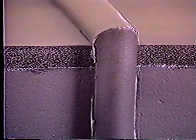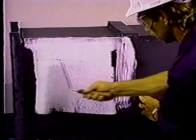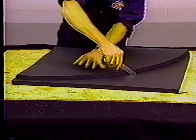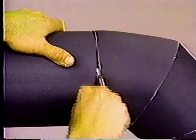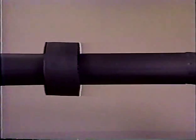If ducts or any other flat or curved surface or insulated piping is located outdoors, it should be protected with a protective coating, brushed or roller coated. For best appearance, apply two coats. When the job calls for foam insulation, all you need is a sharp knife and your now-sharpened skills to work with this efficient insulation. Make sure all seams and joints are tightly sealed and the insulation covers completely. It's easy when you know how.